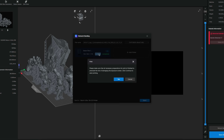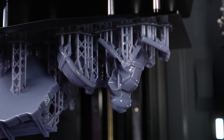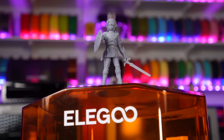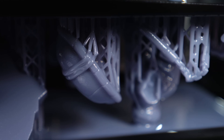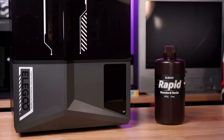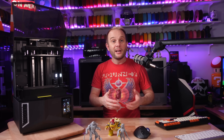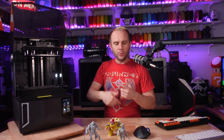I'm not remembering exactly what the Pro version offers off the top of my head — that's just the one I'm using — but I'll have that information in the description. As for the print results, I need to take more time cleaning IPA off prints before curing, but I think they turned out really, really good. Both Link and Michelangelo had some very delicate parts, but the supports in Chitubox and the quality of the machine made them easy to remove. I was using Elegoo's Rapid Standard resin. Elegoo also has their own slicer called Satellite 3D — available now for Windows with a Mac version coming — but I ended up using Chitubox.